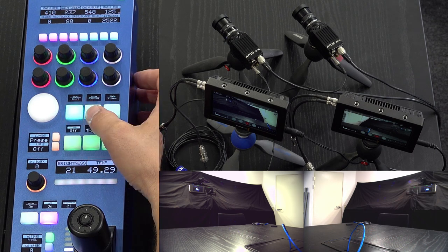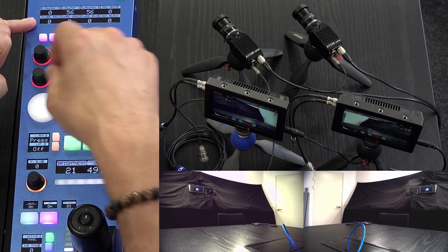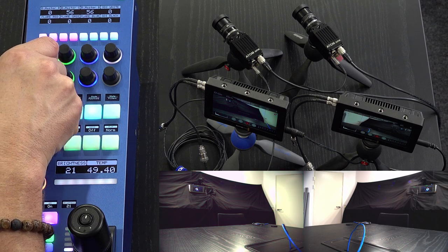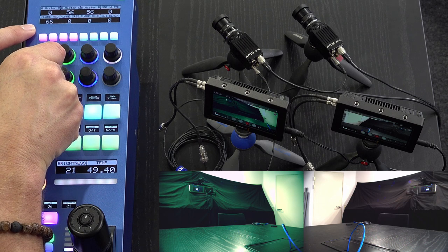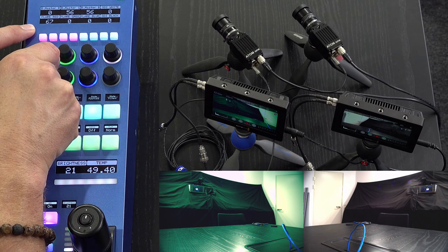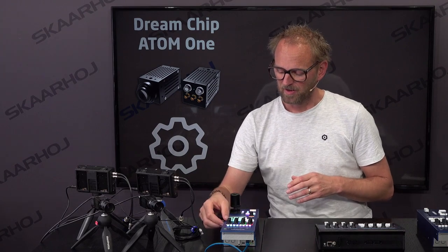On the second page we have black master, red, green, and blue, plus SDI white and black levels and flare compensation. You can see a clear effect on the image as I adjust these. The steps are fairly large, but you can click the button and then adjust in smaller steps — it goes by increments of two, while in coarse mode it jumps by around 11. This step balance was tuned by our engineers to give a quick way to reach a value while still allowing fine-tuning.